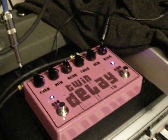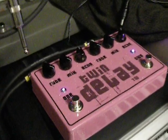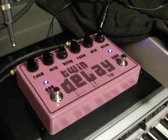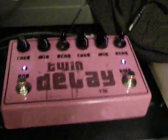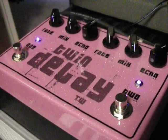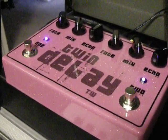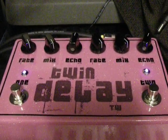It's kind of an interesting thing — not really voltage controllable. I am a big analog guy, but this is technically a digital delay with some analog filtering techniques built onto the PCB. Really though, it's something that's got a good sound to it. I'm very pleased with my build, and it's one of those things I will definitely use quite a bit — that's really the whole point of building something for yourself. The PCB is running about $14 each. The parts are just three pots, a chip you can get for about $2, and a TL072 — in my case I used a higher quality op amp. So probably looking at about $30 each for the parts, plus whatever case you choose. Thanks again for stopping by, see you in the next video.